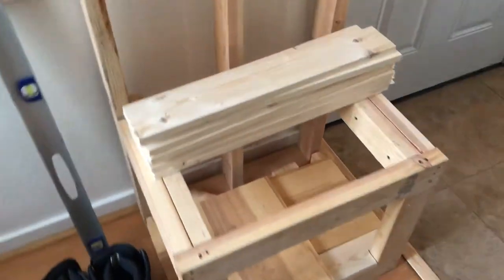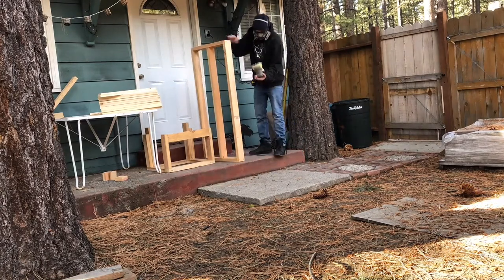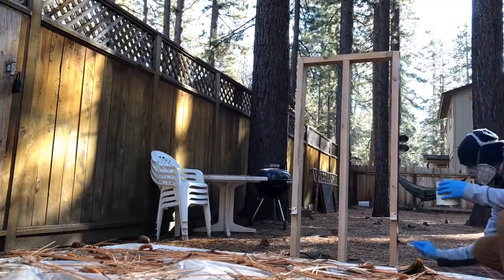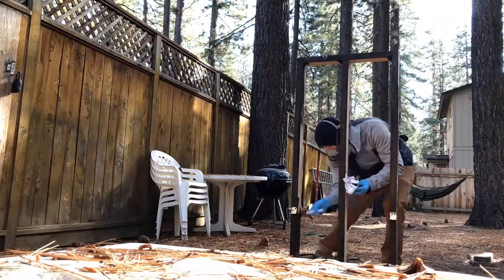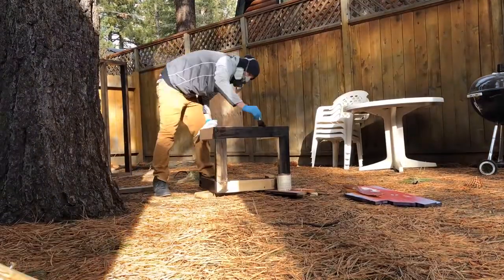The fascia, bench, and shelf are all going to be 1x6, 1x4, and I have one random piece of 1x12. I sanded everything down with a handheld little orbital sander — it was a good little buy. 120 grit. Before we start staining everything, I made sure to wipe it all down to get rid of the dust. To match the coffee table and entertainment center, it's a dark espresso and a colonial maple as the two colors. It's a simple wipe-on stain. I don't have a garage, so I do it outside at the detriment of my back.